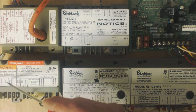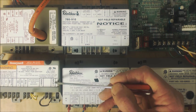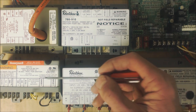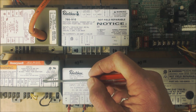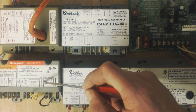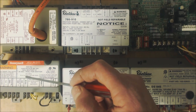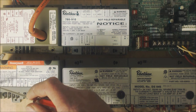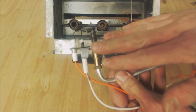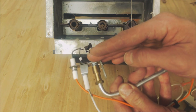When that happens, you're going to get 24 volts from PV to the pilot valve and back to MVPV, which is the common. At the same time, you're going to send anywhere from 6,000 to 20,000 volts out the spark to the pilot tube to ignite the flame. You also have the sensing rod, which has to be enveloped in the flame. The sensing rod sends anywhere from 90 to 120 volts into the flame, which gets rectified and comes back as DC microamps on the GND burner terminal. Once the control senses the flame, it powers 24 volts on MV and comes back through the common MVPV — that's your pilot ignition system. You light the pilot first, it proves the flame, then it ignites the rest of the burners.